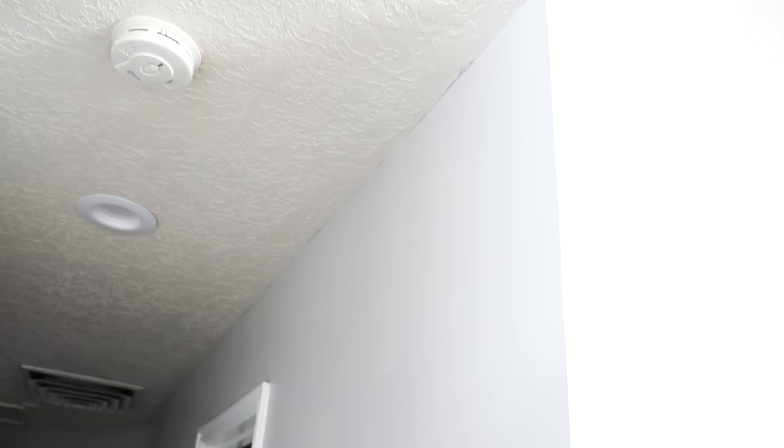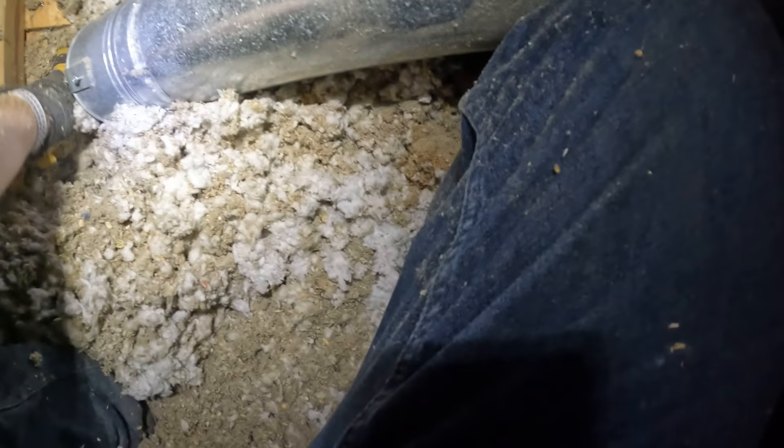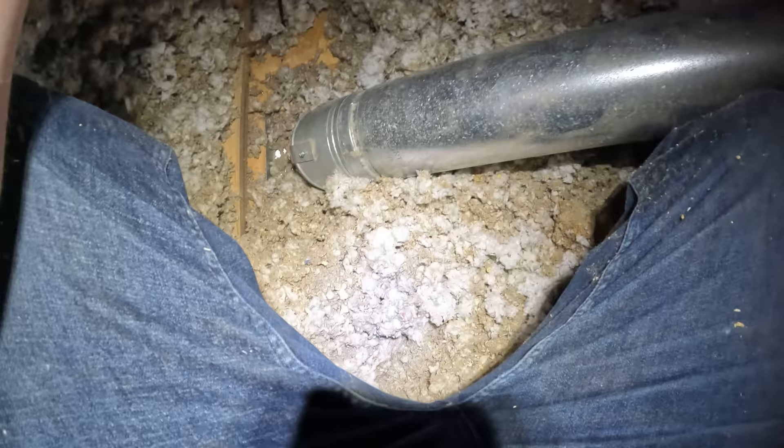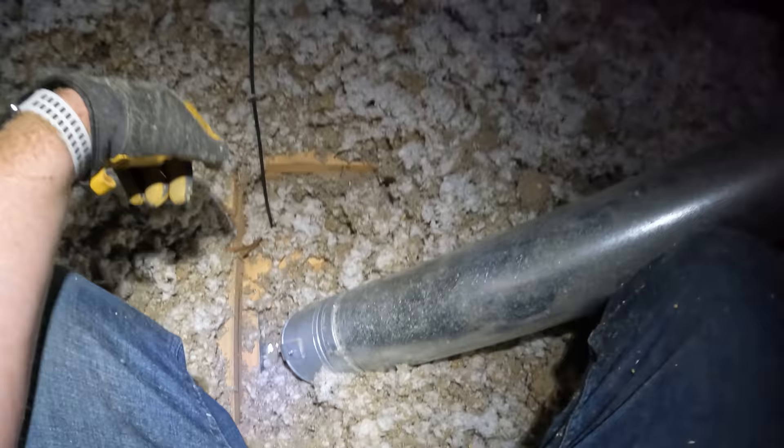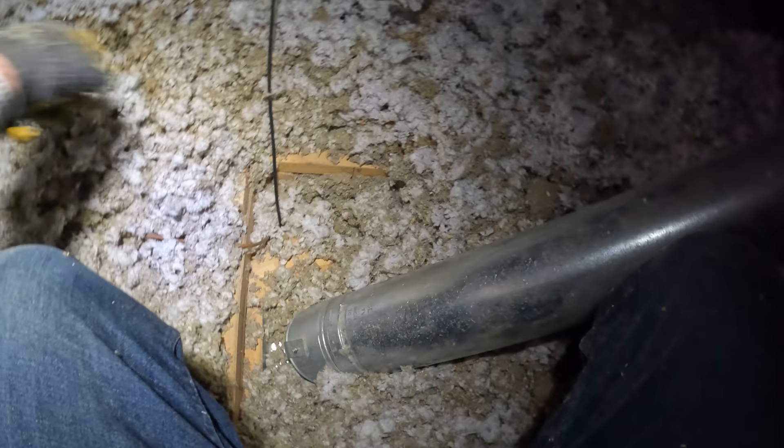Coming in here, I found where I want to go down. This is a little exhaust that goes down to the furnace room, so I figure if I drill down here through the wall. But sometimes you luck out — I found this coaxial cable that's currently not attached to anything. This coaxial cable goes straight down into the room, so what I can do is use this as my pull wire and attach my Cat6 cable right onto that and then use it to pull down right through.